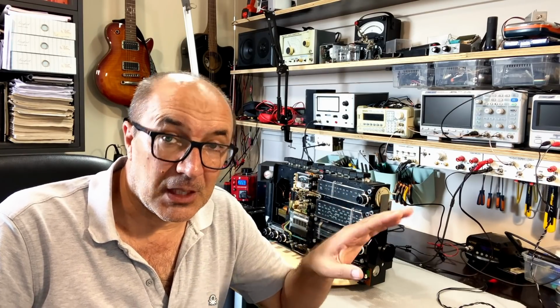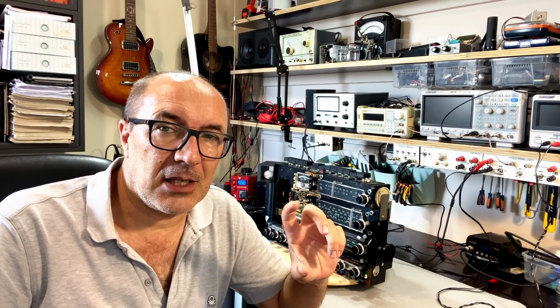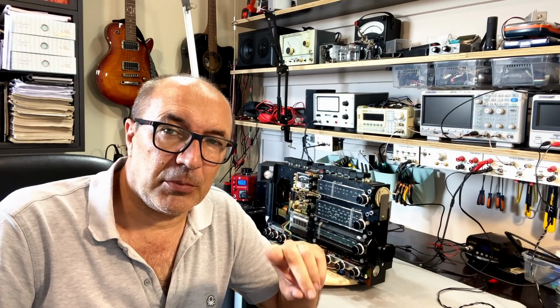The second thing is the time that I swept the sweep for. I put it on 28 milliseconds and 14 milliseconds, and something was pointed out to me that these filters do have a reaction time. And it appeared that some ringing was actually happening on some of these filters. Stefan pointed it out to me as well, that perhaps I should make the sweep slower. And I can do that because this is a digital oscilloscope, so it does hold on to it.